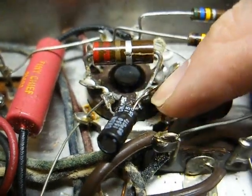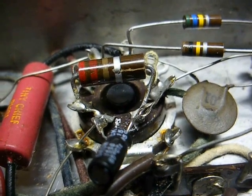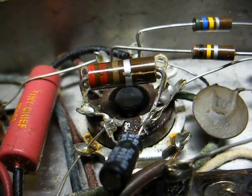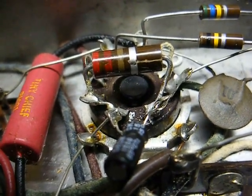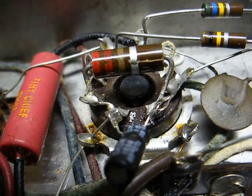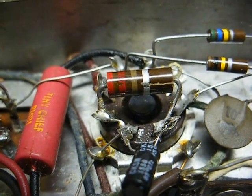The resistor was fine, so here's the new capacitor soldered in place. The banded (negative) end goes to chassis ground, the positive end goes to the cathode of the tube. When soldering, make a good mechanical bond — make sure your iron is hot, tip is clean, always heat the work not the solder, and apply just enough solder. Let the connection cool before disturbing the joint, or you'll get a cold solder joint. Once cooled, cut off the excess leads, and you've got a connection that'll last another 60 or 70 years.